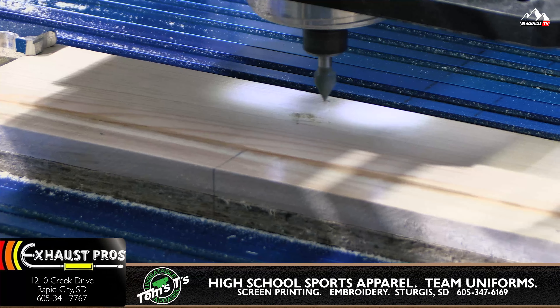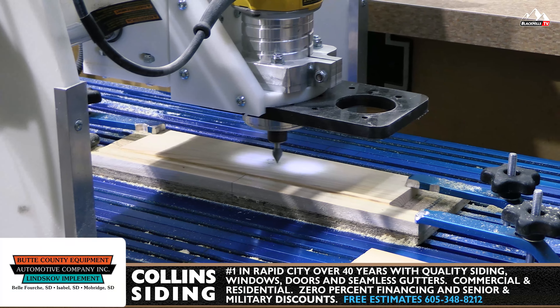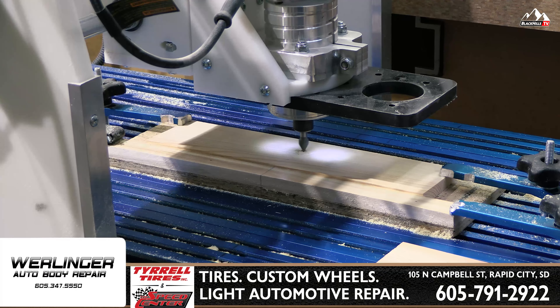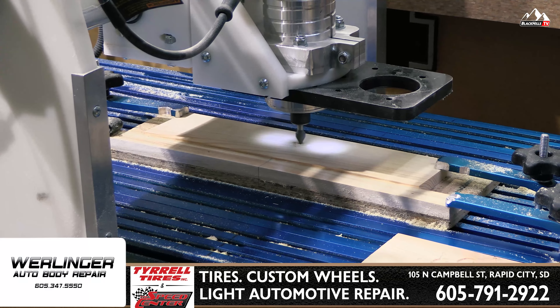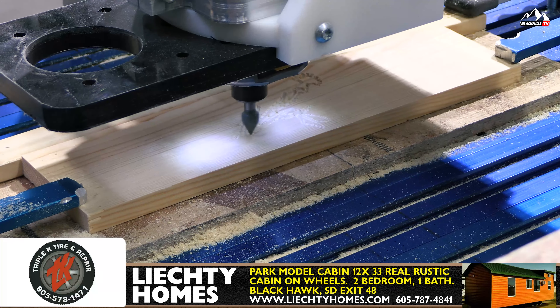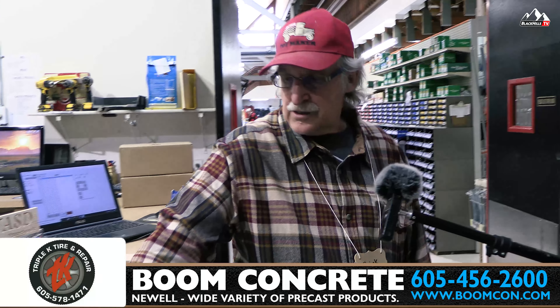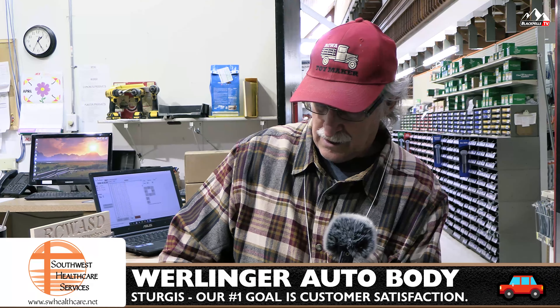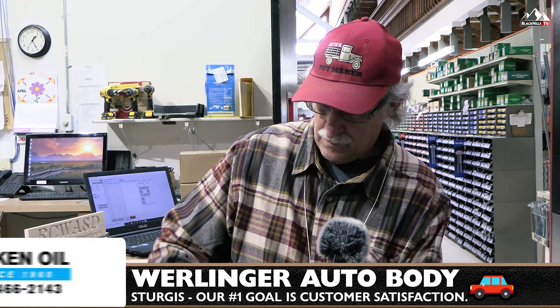Eight minutes worth of cutting, and sometimes it's anywhere from 15 to 20 minutes to draw it, or if it's a more complicated drawing it can take quite a bit of time. The advantage is that once you have it drawn and in the computer, you can repeat the cut over and over again without any trouble. So making just one is not cost-effective. The more intricate the drawing, the longer it takes because there are more positions that it has to be in. It'll cut this bee in just a couple of minutes, and it'll cut the ladybug also fairly quickly. But as it's starting right now, it's starting with this pattern which has a lot more information in it. So this is the majority of the eight minutes that's going to be spent on this position, and the other two will cut fairly quickly.